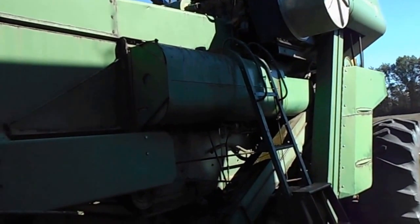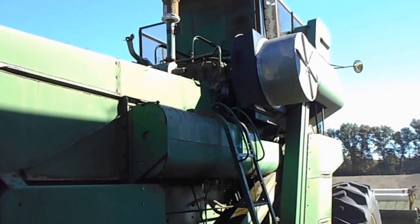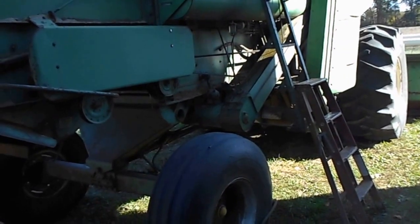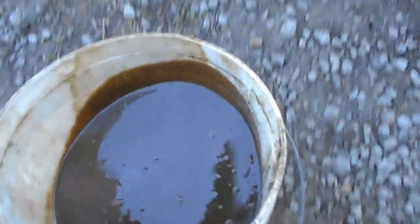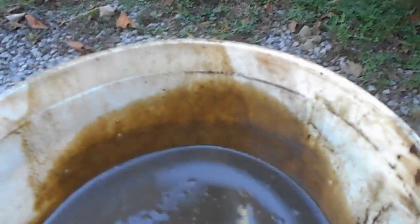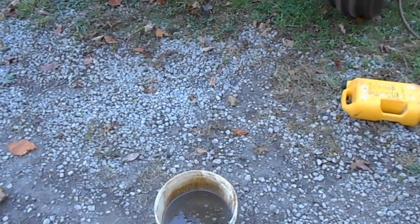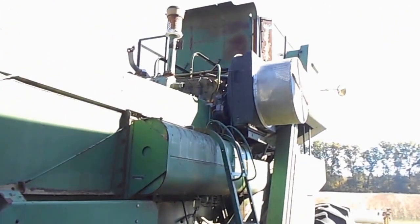But this is something else. This is thick, gooey almost, antifreeze that came out of there. So I'm thinking the water pump actually might be all right. It's just got a lot of oil in it, and oil doesn't cool like water. So I think we're going to go get some motor flush